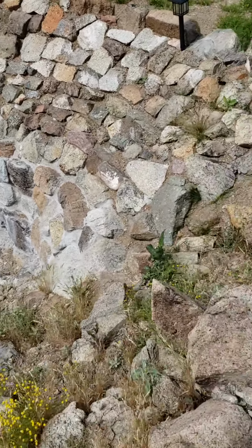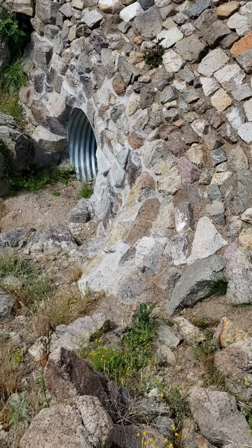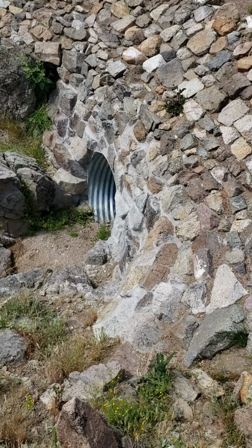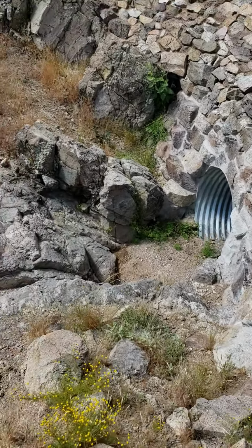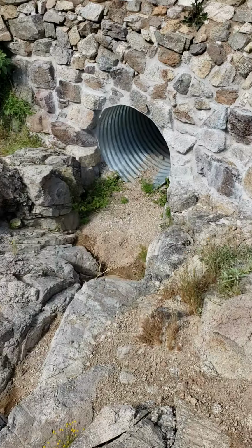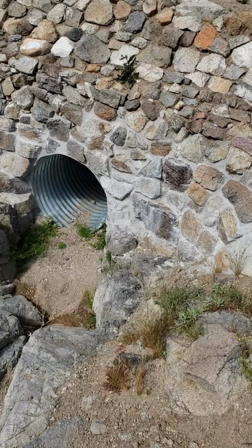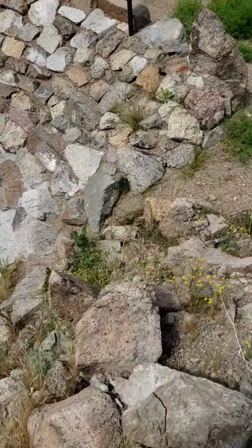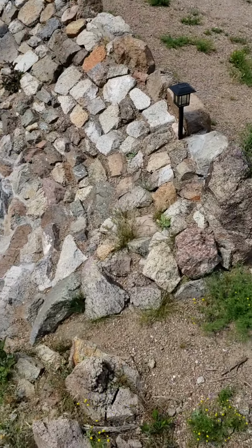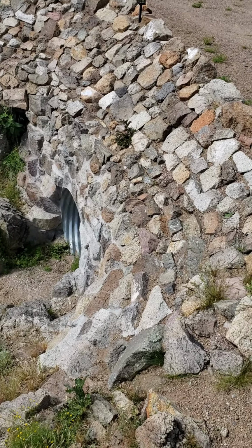A retaining wall without a building permit can't be more than 4 feet. Well, that first 4 feet is about 80 degrees, which classifies as a retaining wall, and it's solid concrete. It's all concreted in, mortared in, and sitting on bedrock. Above that, it kicks back over to 45 degrees, which is erosion control, no longer a retaining wall. And the 45 degrees is important to remember.